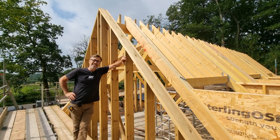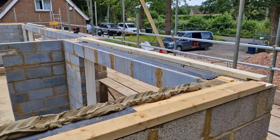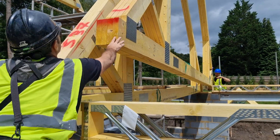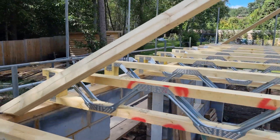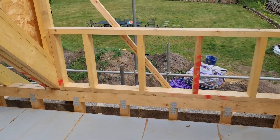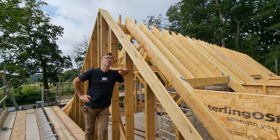Welcome to my channel. This is the hybrid roof I've been working on. You will have seen us put the wall plates on originally and then crane in the main components, which were the large attic trusses. Once I've landed those, they support the floor joists. Once the floor joists are in, we can then lay our floor which is protected from the weather — that's how the system works, and that enables us to build the roof, creating a safe base to work on.